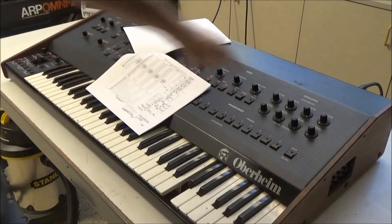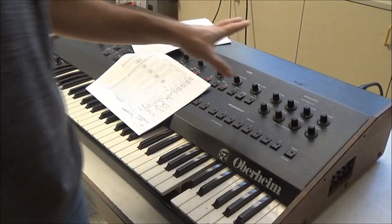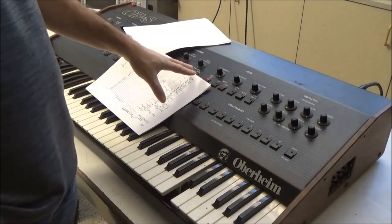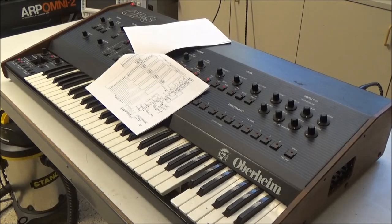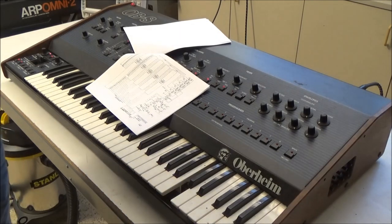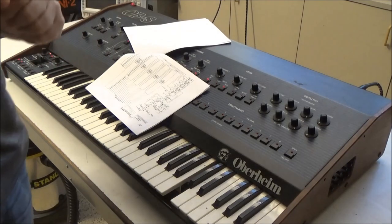I really doubt that all three of these jacks have failed, or that both of the final VCAs on those two separate boards both failed. Anyway, at this point, we have a good idea where we can start our troubleshooting when we get inside the synth. We're going to start by making sure that connector to the jacks is plugged in, and if it is, that would also be a good spot to start looking for a signal and tracing this problem with an oscilloscope.